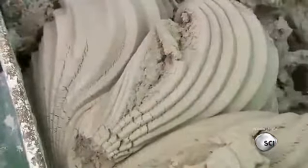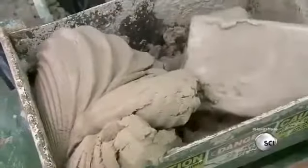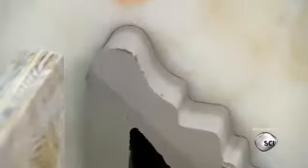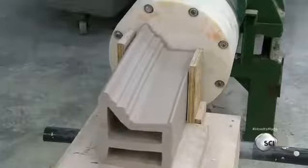At the ceramic factory, they mix water with clay, feldspar, and silica in a pug mill. Together, these formulate a clay blend. Once the mix is the right consistency, the operator presses a button, and the mill switches to extrusion mode. This forces the clay blend through a mantle-shaped die and produces a 10 to 15-inch long extruded mantelpiece.